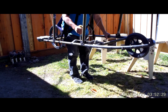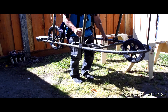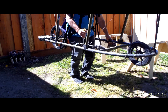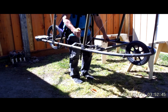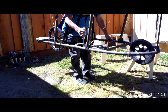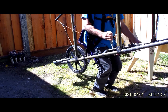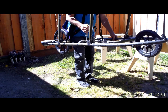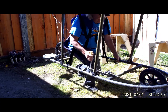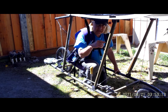I can move a hand down to the horizontal — I'm close to the flap handle and can operate that. Normally I'd be hooked into the suspension straps, which give me enough balance to grab the flap handle and let it hang on the harness. I run the control stick over here and have enough control for the launch. For landing, you're a little hunched over and you flare and come in like this with a little run to land, or you try to bring in a full stall and just stop. But then you've got to set it down.